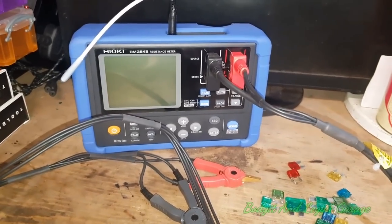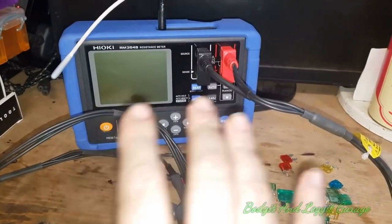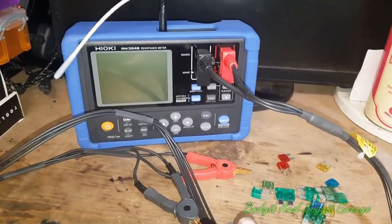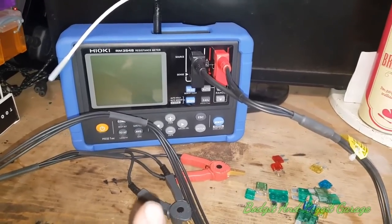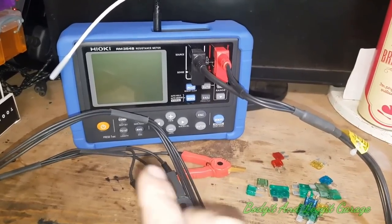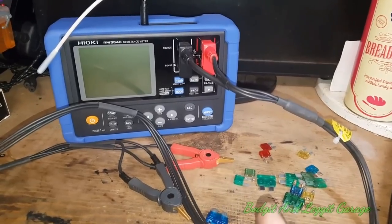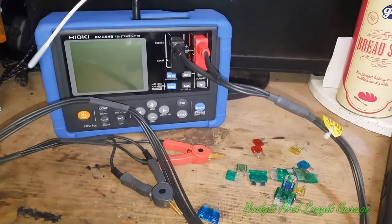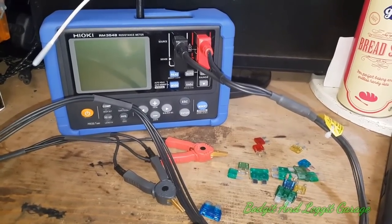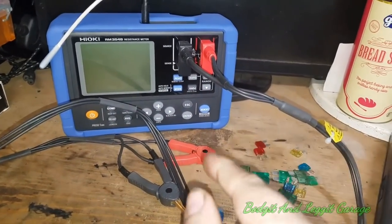This is really really accurate, so I have to make sure everything is at the same temperature when testing. You really need to be precise, especially on electric vehicles and windings. You need to keep this machine and the vehicle in the same place for a few hours so they both reach the same temperature. Just the heat of my hand squeezing a fuse will change the reading dramatically.